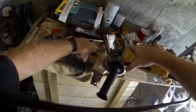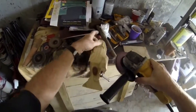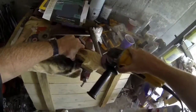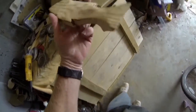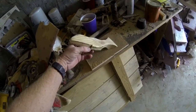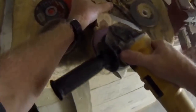Then the process — we're going to start to make that fish thinner. You could also use a scroll saw or a bandsaw for this. I'm just going to use a disc grinder with a coarse sanding wheel — I think this is a 36 or a 40 — and this removes the material pretty quickly. You can see it's starting to take shape. We've got the 45 degree angle cut on the bottom for the stand, and I'm just going to make this so that the fish has a curved shape to it.